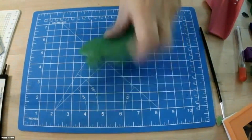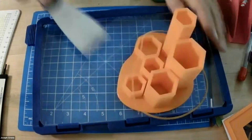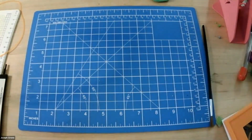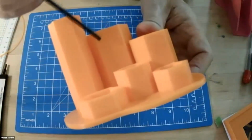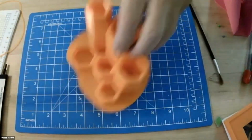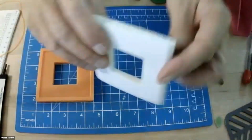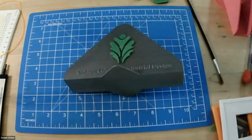It's very important as we start to design for 3D printing to work with our build plate adhesion. Okay, here's another example. We can take that part off. Notice again that we want to have some kind of identifying marks on the print, because some of them will look quite similar. Someone has engraved their name. There's a difference between engraving something in AutoCAD, like this print right here, which was done with text, versus 3D. But we definitely want to put some identifying features onto the print.